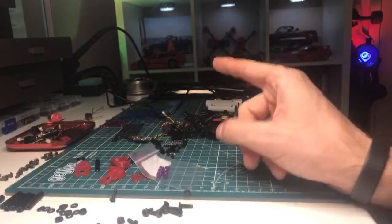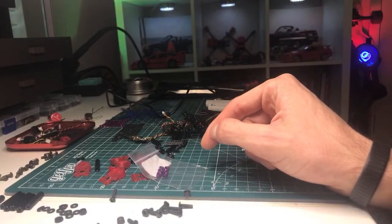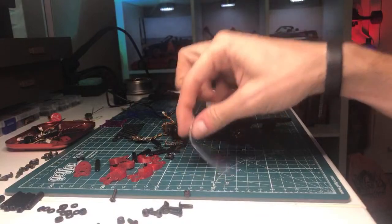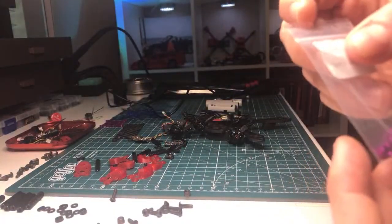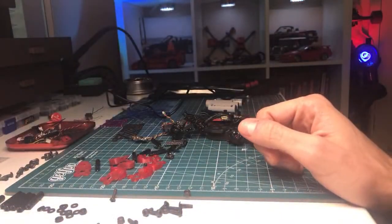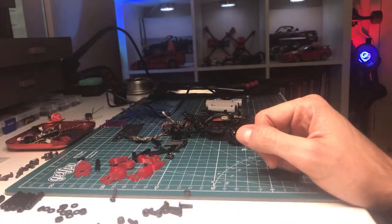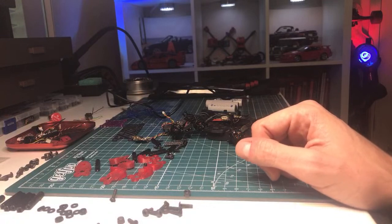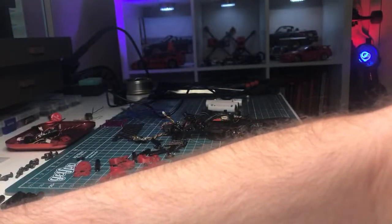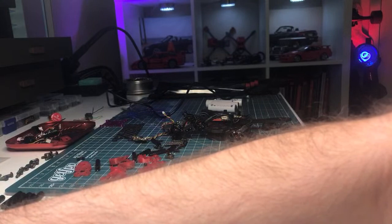And then there's also some 1404s that would be good as well. Just pay attention to the KV. On a 2.5-inch prop, you want, oh Christ, I lost my train of thought. You want 5,000 KV on 4S, or you want 6,000 to 6,500 KV on 3S. All right, so there you go, Marcos. Great question. Let's get caught up on chat.